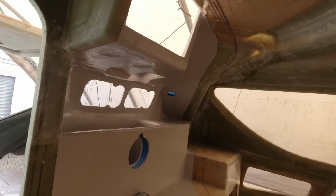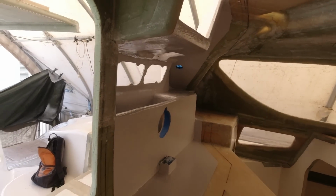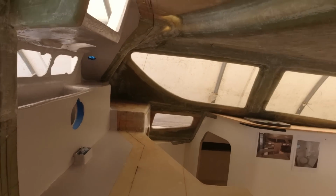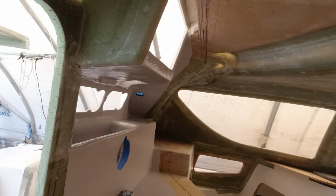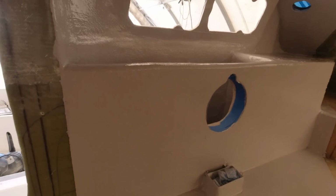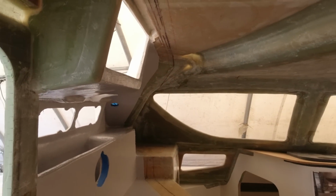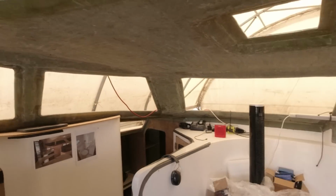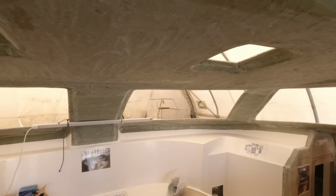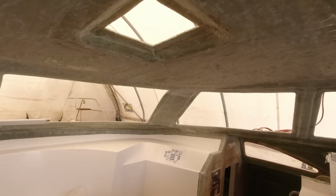So the nice thing is when you're actually looking inside your cabinets, you're not looking into a dark, resin coloured colour like this. It's a horrible thing to look into when you're looking for nice lines. I'm going to have a lot of NMEA connectors and everything along this panel here, and I need to have good access to them. So you can actually mirror the multifunction display onto a television and certainly onto an iPad, which could potentially be sitting over there in a nav station. So there's a lot of good functionality that we can go with now that wasn't available up until a few years ago.